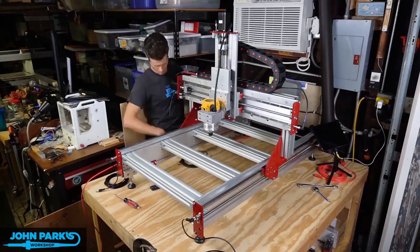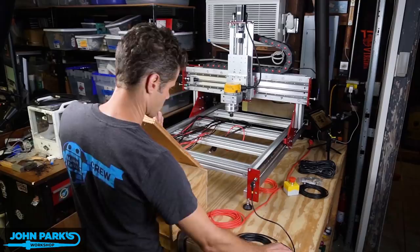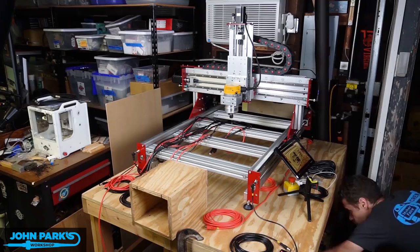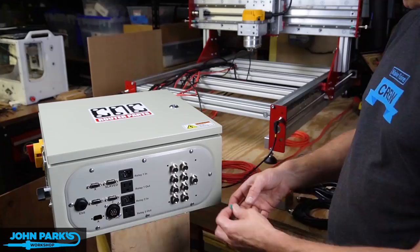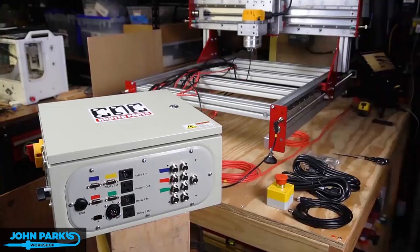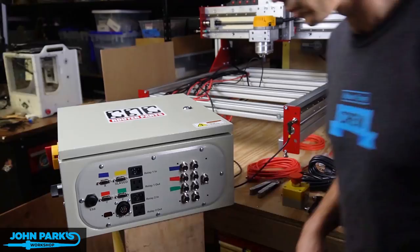You can see I've got my iPad there with the instructions. I'm using my box to lift the bed as I level it and screw the feet in place, and then I'm going to use a hammer and a piece of plywood to do the same on the other side. Now I can tighten those feet into place so they don't go anywhere. Here I'm matching up those color codings I had planned out earlier, so I'll be able to plug in the proximity wires and the motor wires to the controller box without getting anything screwed up.